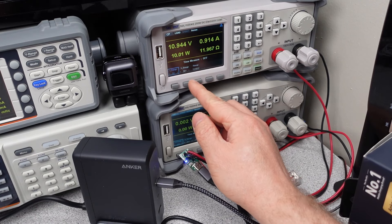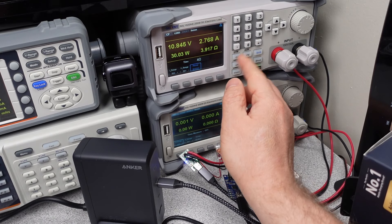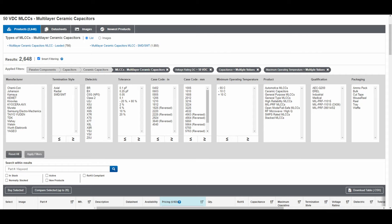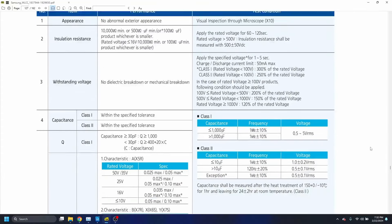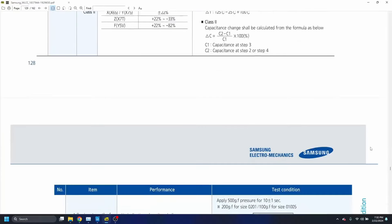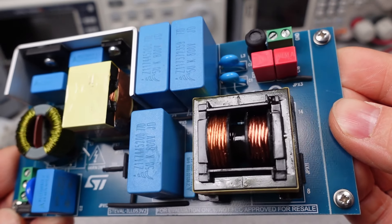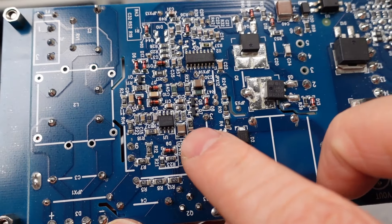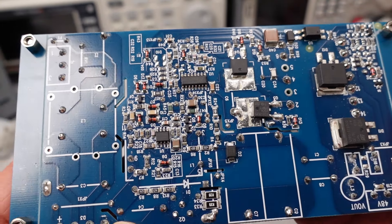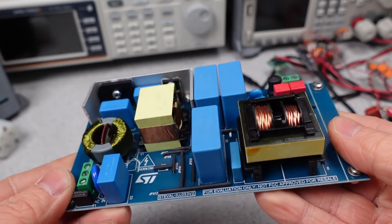If you are lucky, it just stops working. If you are unlucky, it breaks something. More than not, it will hiccup — go on and off and on and off. These are cheap components, but so are some alternate components like multi-layer ceramic capacitors. These are dry components and often subject to a huge range of testing to make sure they are reliable. These components won't suffer the same fate but can break in other ways. There are ways to combat that too, like using two in series at a 90-degree angle to combat bending mode failures. There are plenty of designs out there that happen to be high reliability designs. I happen to have a high reliability power supply I was planning to show in a video but never got around to it. This power supply does away with all of the electrolytic capacitors and uses MLCC and film capacitors instead.